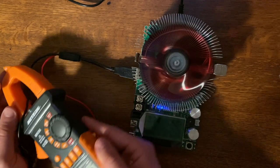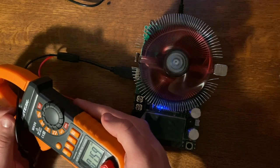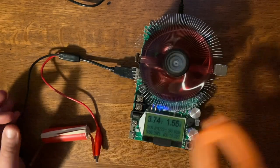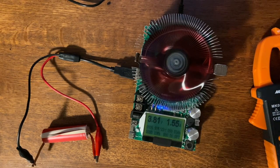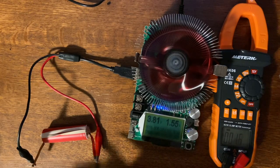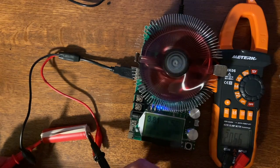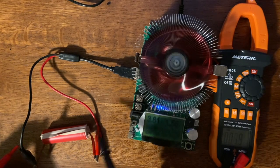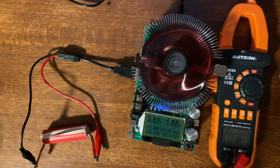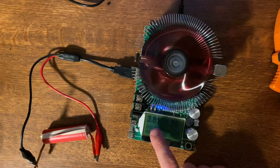The external monitor is reading about 1.59 to 1.6 amps, and the tester is showing 1.55 amps, so it's slightly underestimating the amps but actually pretty close. The battery discharge is doing a really good job — not perfectly accurate, and I've done other tests where I found it to be a little bit low. Let's also check the voltage: the tester says 3.81 volts but I'm reading about 4.1 volts on the battery. I don't think this is due to wire losses as I've tested elsewhere and it didn't seem to have that problem.